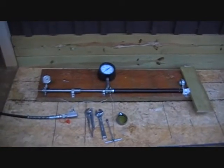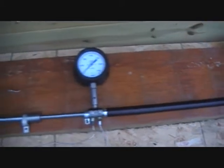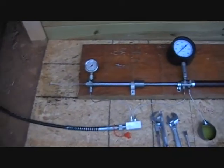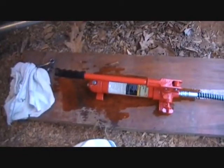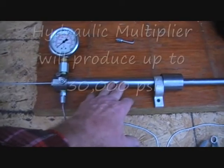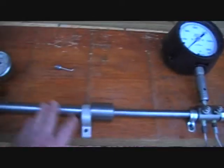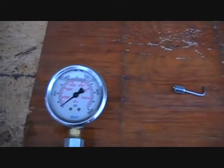We're all set up, ready to start the test on this lightweight Marauder charge tube. Got it filled with hydraulic oil — it's all primed and purged. Got a hydraulic pump over here; it goes up to about 8,000 psi, into a manifold here. We've got a two-stage system — low pressure side here, which will take the 8,000 psi and bump it up to about five times that, so this is a pressure multiplier. This gauge right here goes to 10,000 psi for the low pressure side.